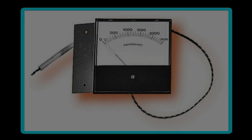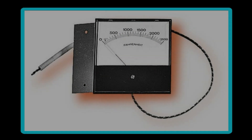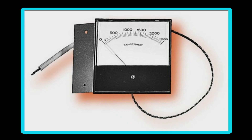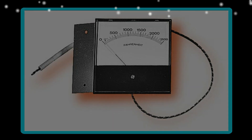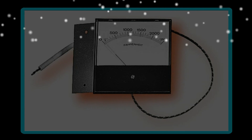To talk about controllers, whether mechanical or digital, we're talking about two things: number one, measurement of the heat inside the kiln, and number two, controlling that heat in some way. What you see on the screen is called a pyrometer. It is based on a thermocouple that looks like a twisted pair of wires inside a sleeve and a meter. The thermocouple converts heat into a small voltage, and the meter reads that voltage and moves the needle up the scale. So this is our measuring device.